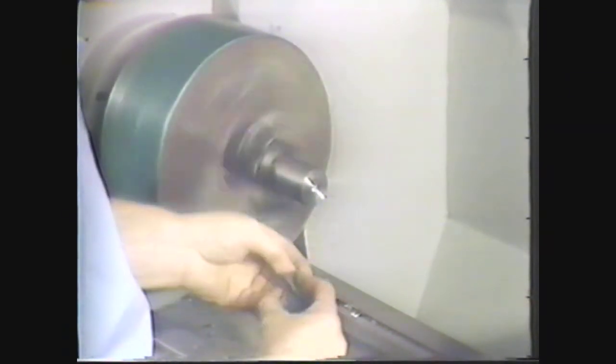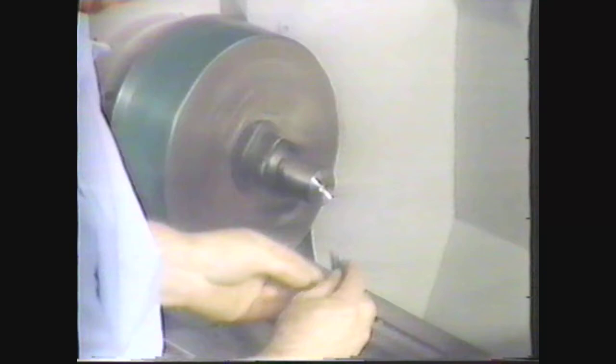If you drill too deep and the diameter of the hole is too large, face off the end of the workpiece to reduce the diameter to the proper dimension. Now polish the center hole to provide a snug fit for the lathe center. Use a piece of fine number 400 polishing cloth folded, or use a tapered dowel rod sharpened to a 60-degree angle with the polishing cloth wrapped around the tip. Break the sharp corners with a smooth file.